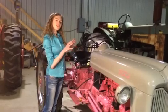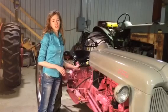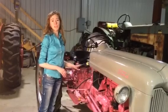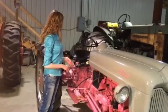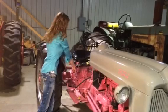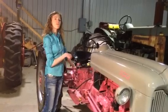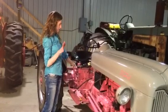When you are working on a tractor that does indeed have a hydraulic issue, you will definitely need to blow pressure in there longer — you might need to blow for up to a minute. Just keep testing the hydraulics until that works. When your hydraulics work, make sure that you don't pull that blow-off nozzle out of there right away because you'll have pressure and the hydraulic oil will come and blow up on you.